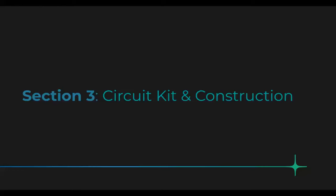The values from 200m to 500, that's going to be the maximum value you'll be reading. It will also set the precision of your voltmeter. So, let's say for your batteries, when you have your power supplies, that's only in the output of the power supply, right? You have 9 volts on this side, 5 volts here, and 3.3 volts over here, how we designed it to be. Now you can measure this output using this. So first, you want to set your dial to 20 because 2000m is just 2 volts. All of our readings are going to be over 2 volts, right? So I'll do that first.